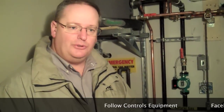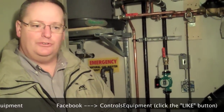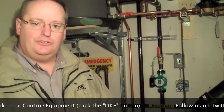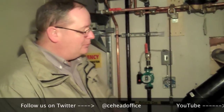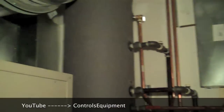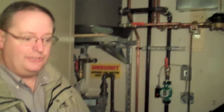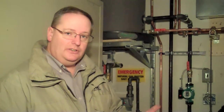As the temperature changes outside, with the assistance of the building's controls and automation, the boiler will produce heat as it's required, as opposed to old-fashioned traditional boilers, which would just stay at one hot temperature no matter what. So again, it's a smart control, and it is indeed smart. It also controls the Squire indirect hot water tank. The domestic water load in the building is produced via this boiler, again at high efficiency, in the range of 92 to 98%, which of course means that 98% of the heat produced in the unit, the building gets, and only 2% goes up the old chimney.